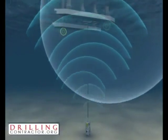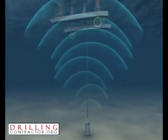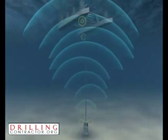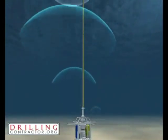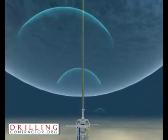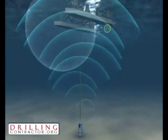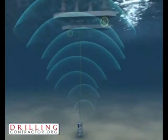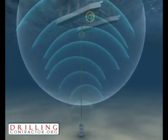NASMUX offers bi-directional acoustic communication. Commands can be sent from the surface to the subsea electronic modules, or SEMs. A variety of information can be sent from the SEMs to the surface several times per second. Regular monitoring information, such as valve states and analog readings, form the bulk of the transmissions from subsea to surface. The operator can always command a request for specific information as necessary.